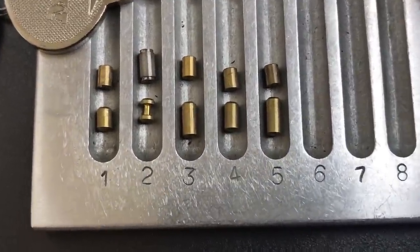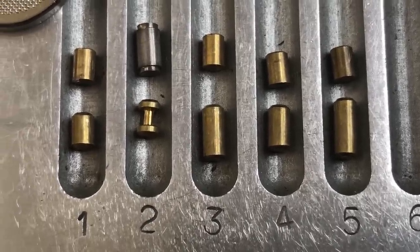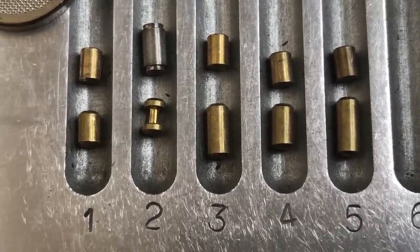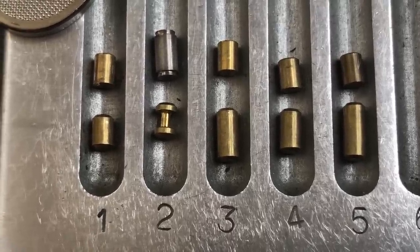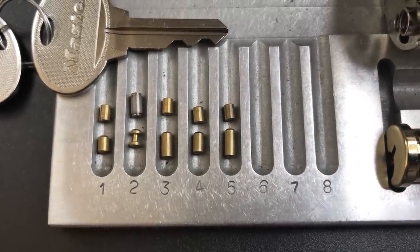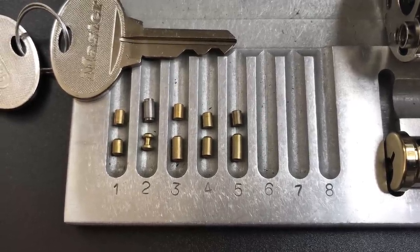As you can see, all of the key pins are double-sided. I usually don't like to see them because by making them double-sided, we put a taper right at the shear line that makes the lock just a little bit easier to pick. Key pin number two I was surprised to see — a very deep spool, which probably makes this lock a lot more rake resistant. On the driver pins, we have four standard pins in slots one, three, four, and five, and then a master bump stop pin in slot two. That's all I have for you on this Masterlock combination deadbolt. If you have any questions or comments, please put them below. If you like this video and would like to see more like it, please subscribe. And as always, have a nice day.